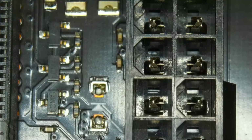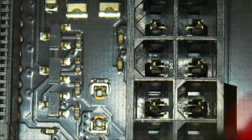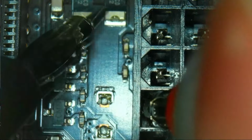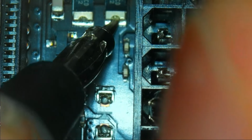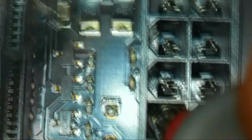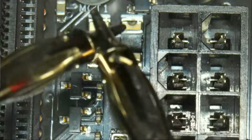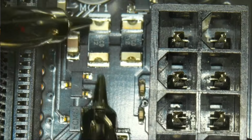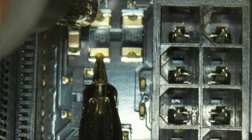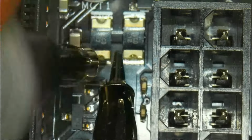And you can see very clearly that these are connected to the 4th pin. So I'm going to go into the 4th pin and to the fuses, and you should be able to hear my multimeter beep. So these are connected. But those fuses, I can show you, this beeps. But if I go into those fuses, there's no continuity on there. So these fuses are both blown.